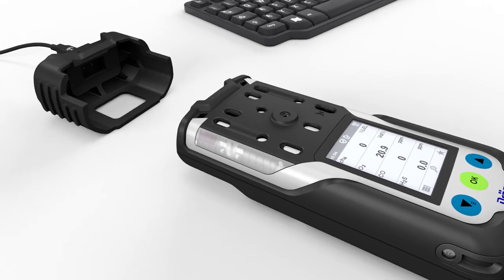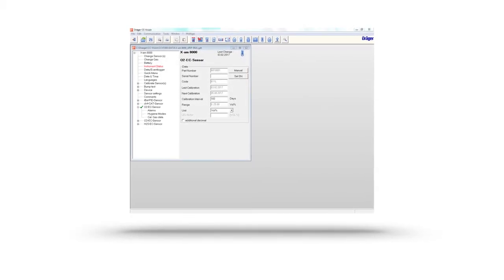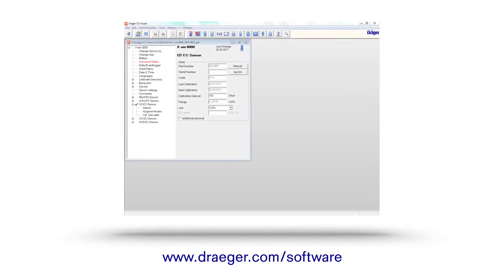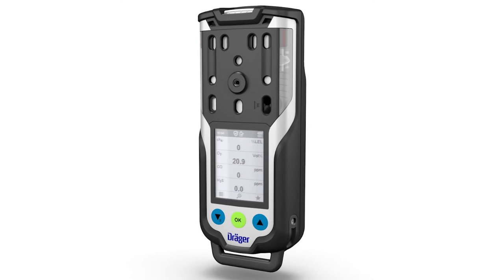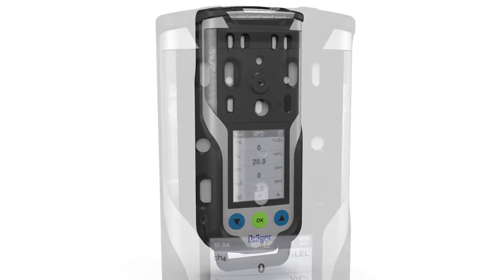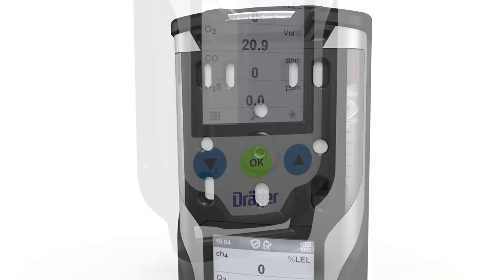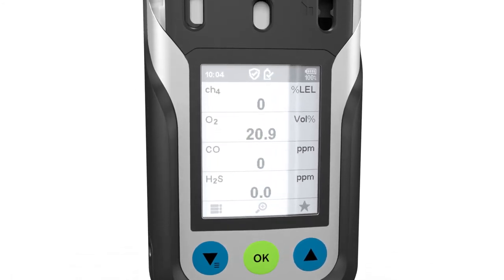The instrument has an infrared interface and you can connect your device to a PC via a USB cable. The CC Vision PC software, which you can download from www.draeger.com, allows you to change settings on the device and read or delete the data logger. Before carrying out safety-relevant measurements, check the function by means of a bump test and inspect all alarm elements. If national regulations exist, the bump test must be performed in accordance with these regulations. A malfunction may lead to incorrect measurement results, which in turn can cause serious damage to health.